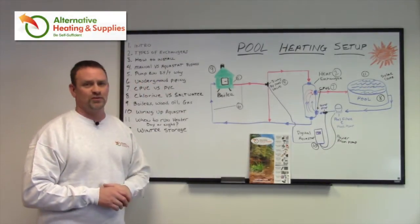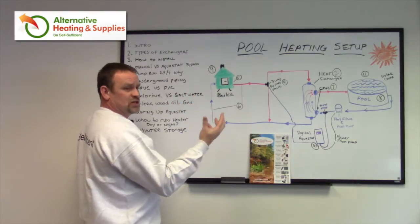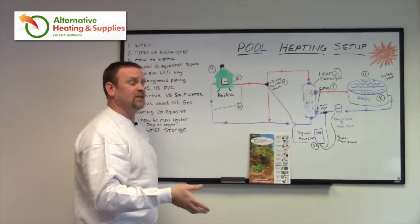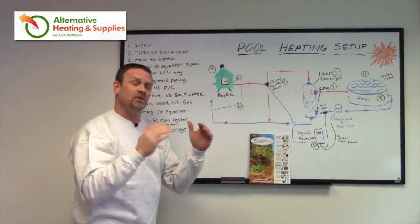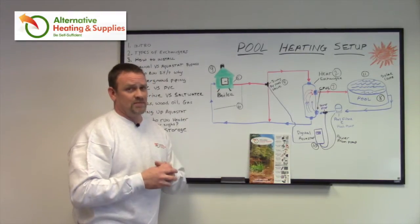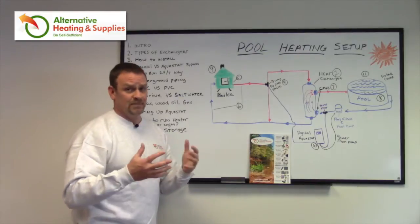I'm going to go into why a pump should run 24/7. In the wood boiler application only, the reason we want to keep this pump circulating all the time with the bypass is that in a wood boiler — especially in the summertime — there's a big tank of water, and the hotter water rises to the top of the tank. The fire chamber is surrounded by hot water, and the top of the fire chamber is the hottest part. So you've got both elements creating the water on top to heat up very quickly. If you're not circulating it, it could bubble, boil over, or percolate. This is a common problem for most outdoor wood boilers. If you keep it circulating all the time, it will prevent boiling or percolating, which in the long run could save the electronics and anything running the machine from overheating, melting, or causing problems.